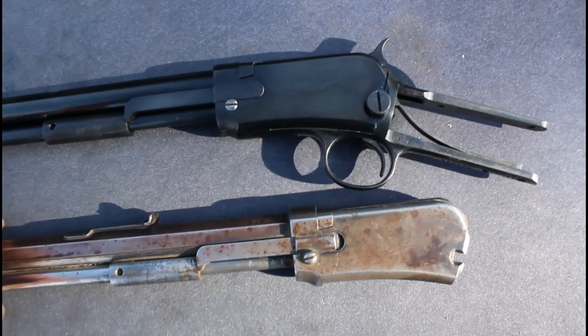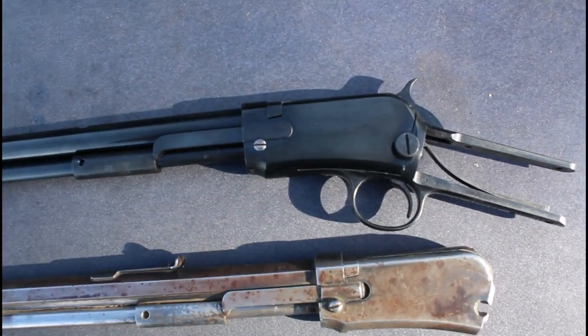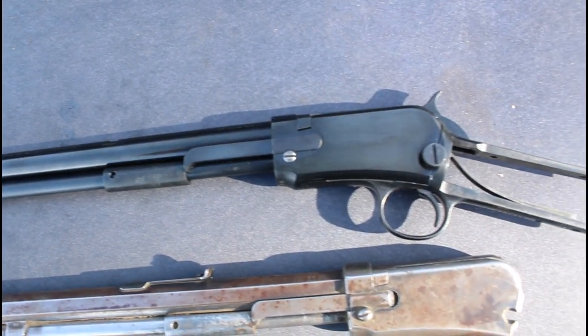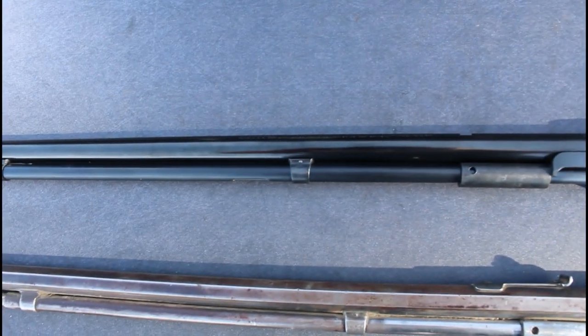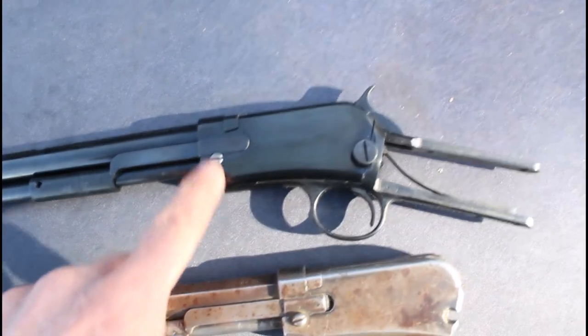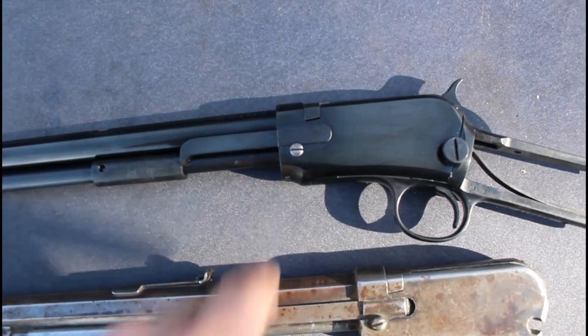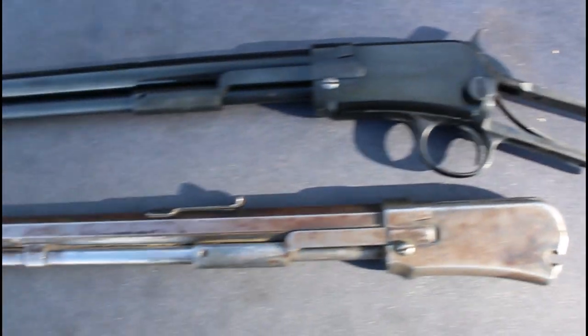So here's a couple of our projects from the Lassen Gunsmith School. We're just finishing up this Winchester 1890 slide action 22. We just went through the caustic bluing class, and it turned out really nice. This thing had a lot of really deep gouges and pits, and we had to spend a lot of time draw filing and polishing it. You can see that the one screw didn't blue, so we're going to have to take it out and try to re-blue it, but the rest of it turned out really nice. Now this week we're switching gears.